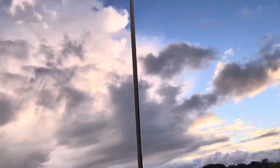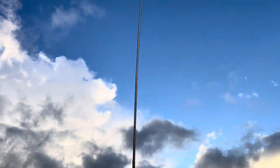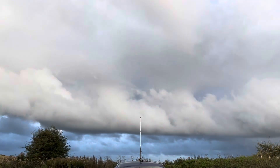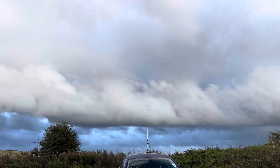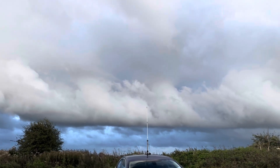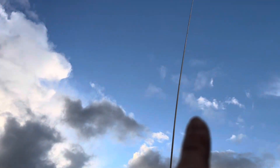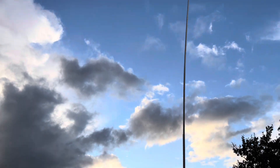It's a really blowy day. I've got the MRQ213 telescopic whip up there, which is basically the knock-off of the MFJ 1971. The distance between this antenna and the other one over there is about a quarter wave - not ideal, there might be some interaction. It's not a pure test, but it'll give us an idea of just how much of a compromise that antenna is compared with this full-size quarter wave, which measures just over 5 metres - about 16 feet high.